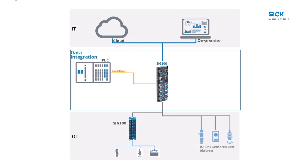The SRG300 is an 8-port IO-Link master that integrates IO-Link devices into higher controller systems like a programmable logic controller, better known as PLC, or to the cloud. It is compatible with three fieldbus variants and features two IIoT interfaces with REST API and MQTT.